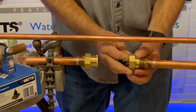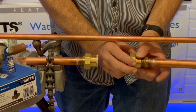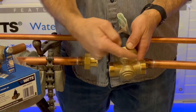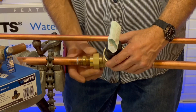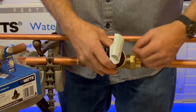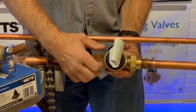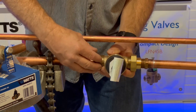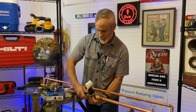We got the old valve off, and earlier in the video we talked about protecting these threads — this is why, because you have to screw this flange of the double union valve onto those threads. You'll screw those on there, then make sure your arrow is in the direction of flow that you need, and tighten that on there. Of course you're going to get your gaskets in there. I'll get both nuts started and go back to slide the gaskets in one at a time — the other side of the union kind of acts like an extra hand for you.